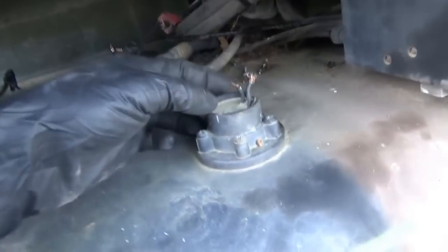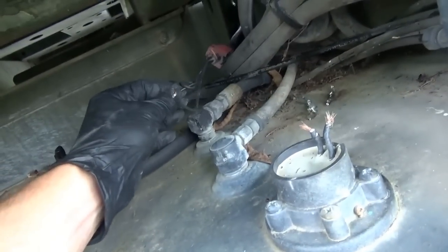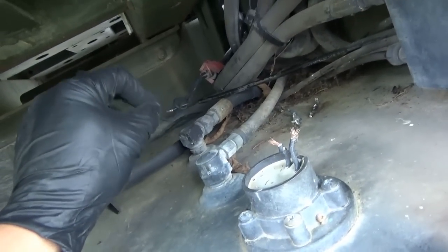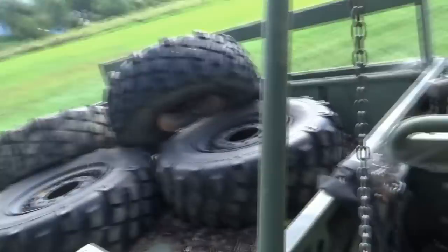So for our gauges, the fuel level sender is right here. We got two wires, there's rodent damage. So I cut those off, clean those up. A ground and a wire that comes from the actual gauge. So, measured voltage here, we didn't have any. Let's follow that wire and we have more rodent damage. This white wire right here, it's all chewed up.